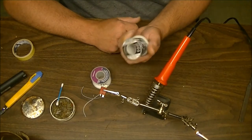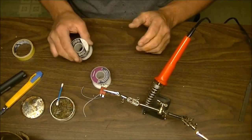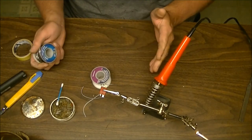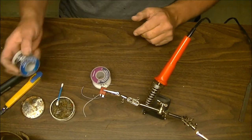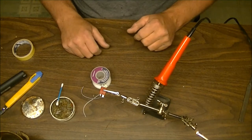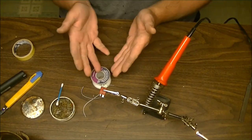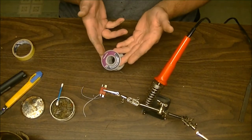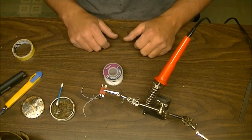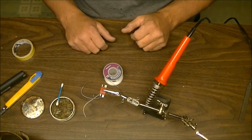There is this thicker higher-tin-rate solder, but this stuff is absolutely garbage. It has more tin in it than anything else. Although it seems to melt okay initially, the second time you want to fix that connection it's not going to melt so easily and it doesn't tend to stick that well. It really doesn't like working with flux paste either. I've been using the 60/40 for close to 40 years — it's the best.